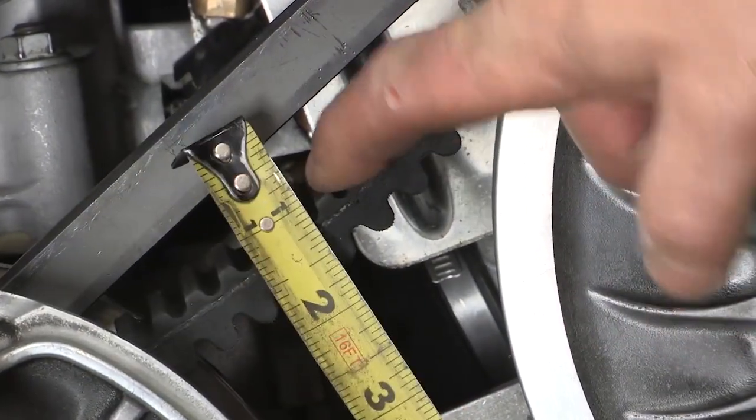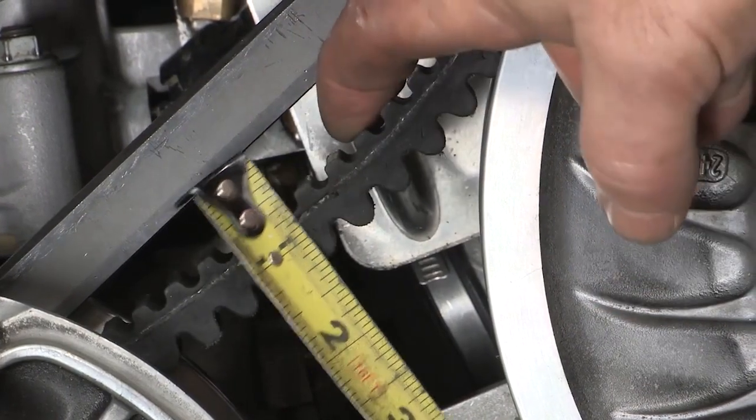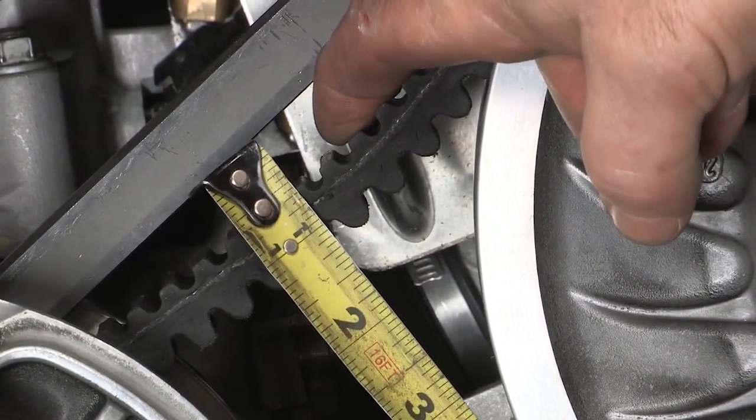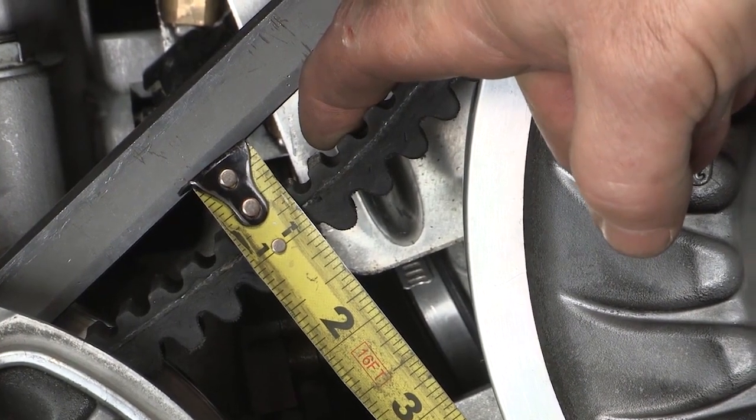You can see the belt rises in the secondary sheaves and that will cause it to be tighter. We're going to take a second measurement — same process, pull down on the belt. You can see that we're about five-eighths of an inch, which means we've gone too far. We need to make another adjustment.